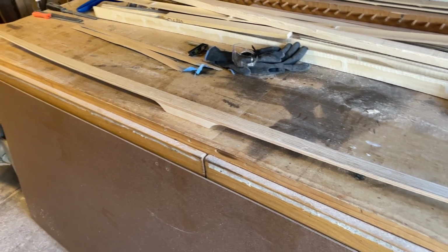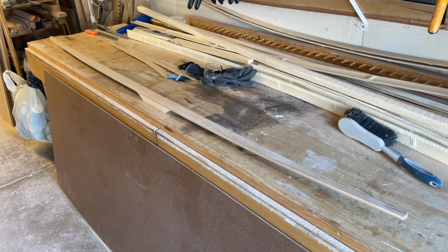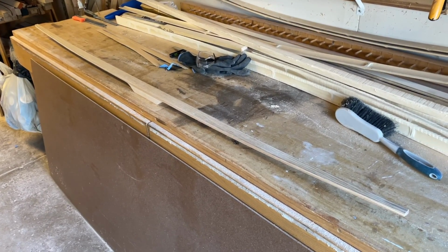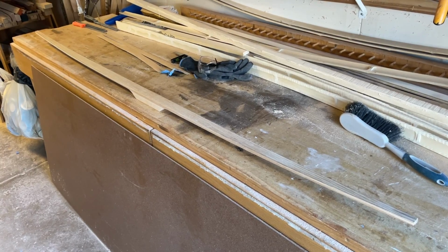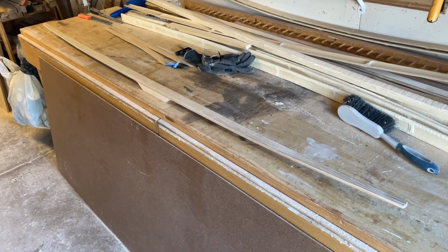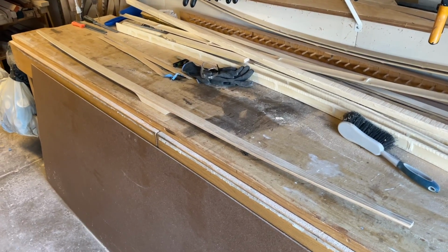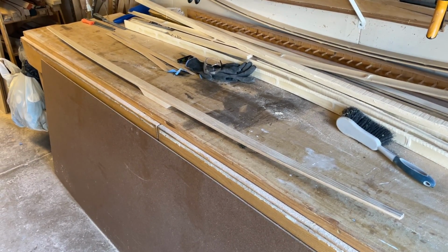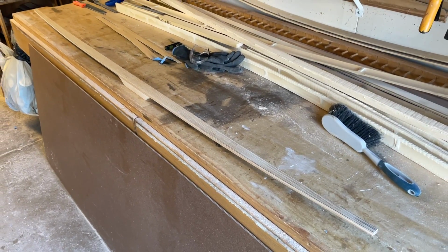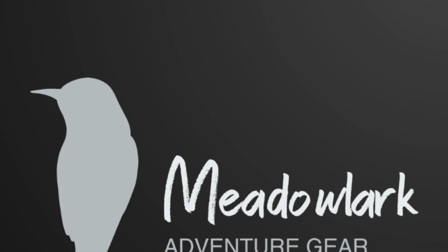At this point, we're just going to tiller her up. So guys, this is the tough part, was getting to this stage. Tillering it from here is going to be the simple part, not to be confused with easy, because it is going to take some work, of course. But it's already floor tillering very easily. I'm sure I could put a string on it and get it to string height even right now. And maybe even be in danger of being under hunting weight. Maybe in that 40 to 45 pound class. We'll see. May have to pike the tips a little bit to get her up to weight.